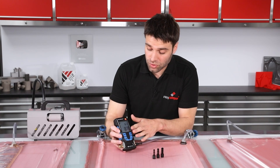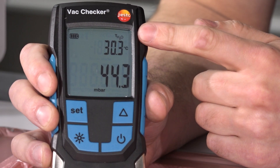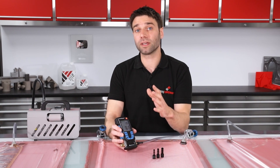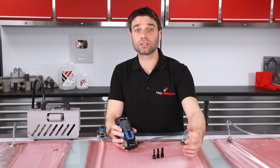As the vacuum is drawing down, the boiling point of water displayed in the top corner is also reducing. The reason why this information is useful is that as the boiling point approaches your ambient temperature, that's when any moisture trapped inside your laminate will start to dry out and off-gas.